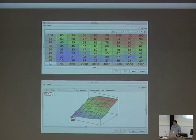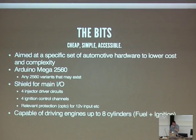How is this actually implemented? It's a very difficult thing to be able to work with every piece of automotive hardware out there — there are vast differences between manufacturers and models. So I've aimed to pick a specific set of automotive hardware, which greatly simplifies the target platform. I'm using an Arduino Mega 2560 — any 2560 variants will probably work, as will any 1280 or 640 AVR chips. The reason is these are the only ones that have sufficient 16-bit timers, and without those timers the Arduino simply wouldn't be powerful enough for this function.